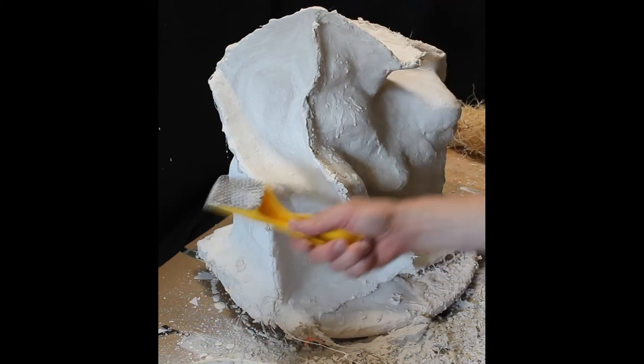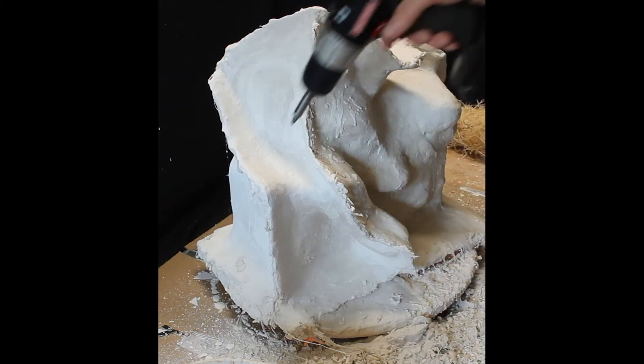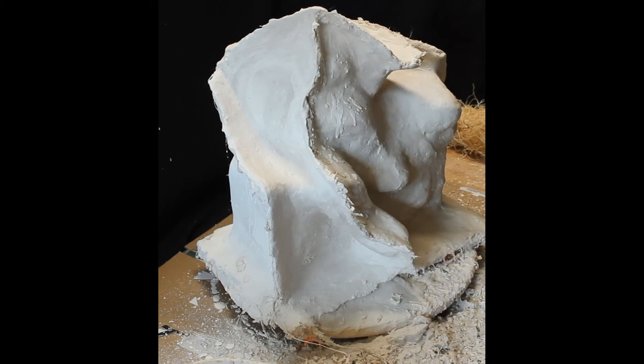You only need to go down as far as necessary to split the mold open, but make sure you get your holes drilled where you want them. I like to pre-mark with a marker ahead of time so I don't find myself wishing I drilled further back — measure twice, cut once. Before I demold it, I think I'm going to put a wood board on the bottom — maybe even the board it's sitting on — then drill a small plug hole in the bottom to pour in my casting material, whatever I decide to use.